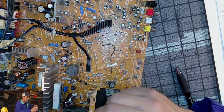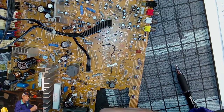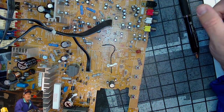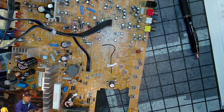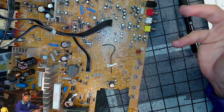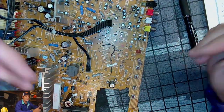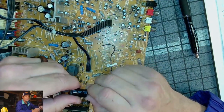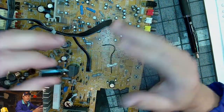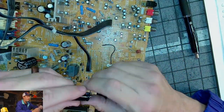Master Safer, hey, yeah, absolutely I have that happen. I have had white residue appear all over the boards after brushing with IPA. It's just the evaporating IPA mixing with some dust that's still left on the board, so you can keep cleaning it. That's why, if you notice, when I did the restorations, I come back with a brush that's non-conductive and brush the boards off, because after it dries, you can generally brush a lot of that off and not have to keep cleaning it. But you can either keep cleaning the board with alcohol or try the brush method. And then make sure you're using at least over 90% alcohol.